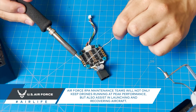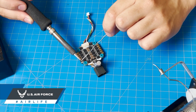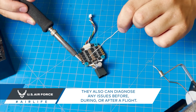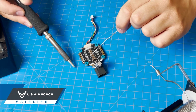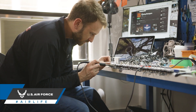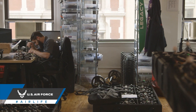Right away, touch the iron to the pad. The pad is heating up, and the best method of soldering is to touch the solder to the opposite end — it makes for a nice pull. Leave it there for a bit and then pull away. When soldering, you want to be sure to do it in a well-ventilated area, so it's best to have exhaust fans around and have the windows open.